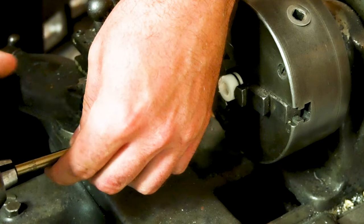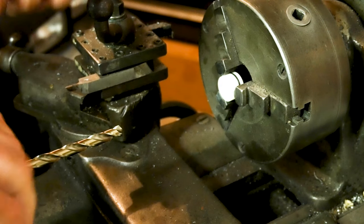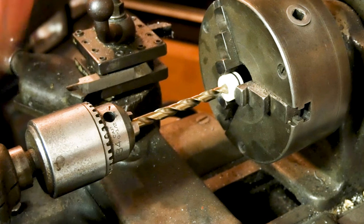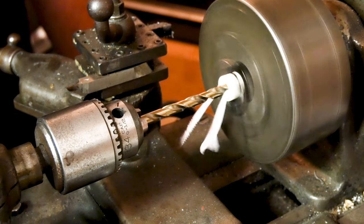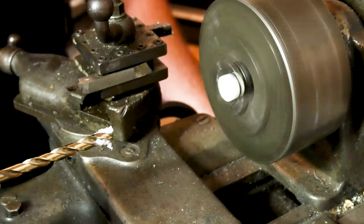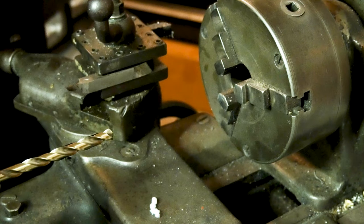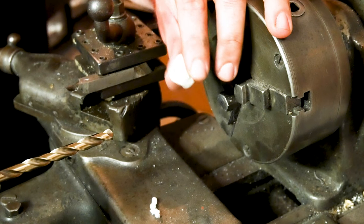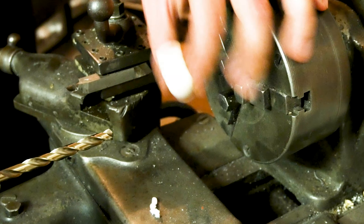So I'm not gonna use a starter on this. This is a 5/16 drill bit. Make sure I'm zeroed. It doesn't need that material at all. It's just extra weight. So we're doing a little bit of weight savings on it. The cup rides at the edge in there, so we're not affecting anything doing that. And if we are, we'll just remake the piece. It's not a very complicated piece to make in Delrin, so that's not bad. I'm gonna get the next piece.